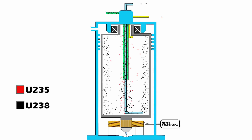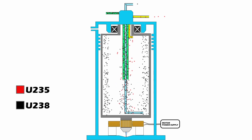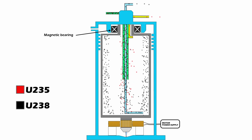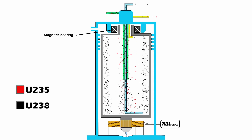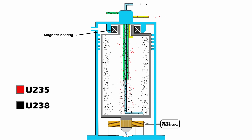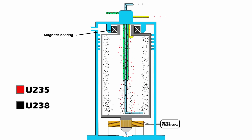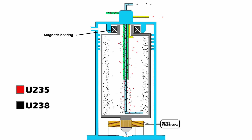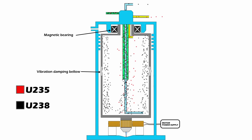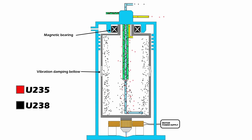This is the main reason why these chambers are hard to create. Because of this high speed, the chamber often needs to rotate on special bearings like a magnetic bearing. This reduces wear and friction, allowing the chamber to obtain a high spin rate. Another issue is the immense destructive force of an unbalanced or resonating chamber. To minimize both situations, the chamber may contain a bellows at a certain point, allowing it to flex and absorb developing vibrations as it spins.